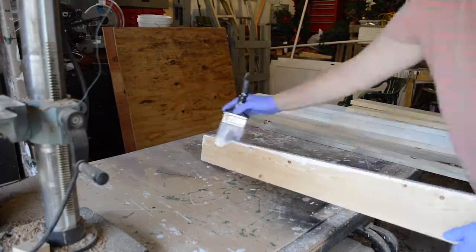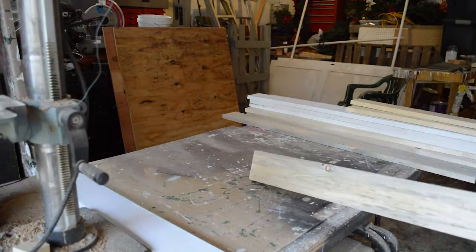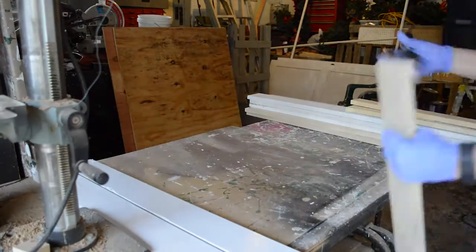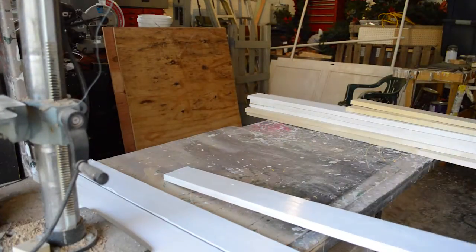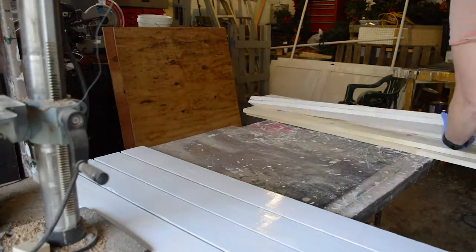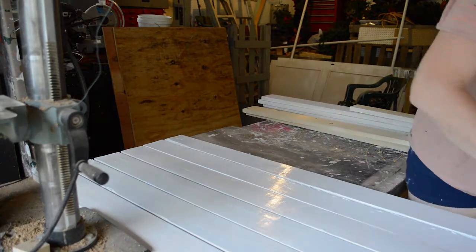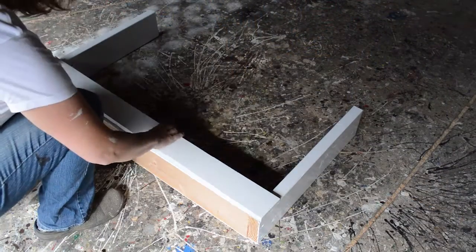Now I have one by four inch lumber and these actually ended up being cut to 43 inches a piece, and I am painting all of them white as well. I wanted to make sure they were pretty so I only coated the front and the sides first, let them dry, and then went back and did the back sides. You're going to need six pieces that are 43 inches long for each box, so 12 total, and I also had some little furring strips cut to about 20 inches long, and that's what's going to go inside of the brush box.